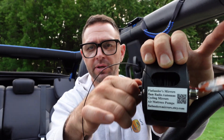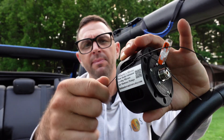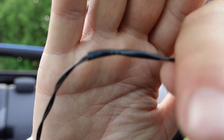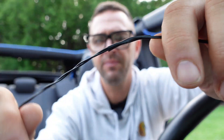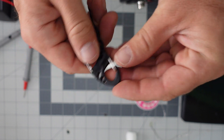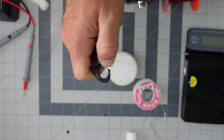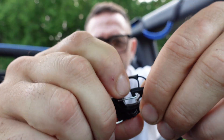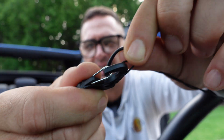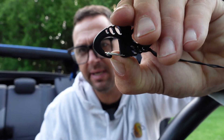At the end of the wire antenna there is a fold-over — you can unfold or fold it more or less depending on where you want to tune on 40 meters, 20 meters, 15 meters, or 10 meters. In my experience, everything was acceptable as-is. I added heat shrink once I found the fold-over position I wanted, which helps keep things together. At the very end there's a carabiner providing strain relief and a place for the antenna to hold on.